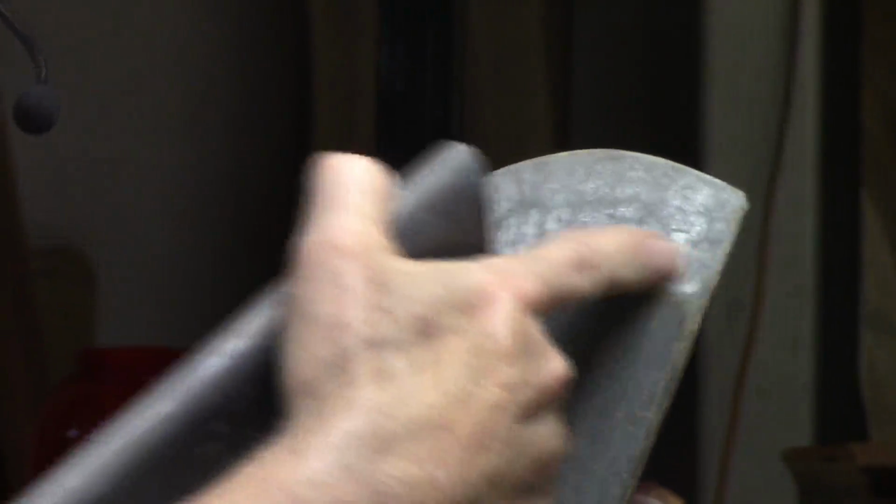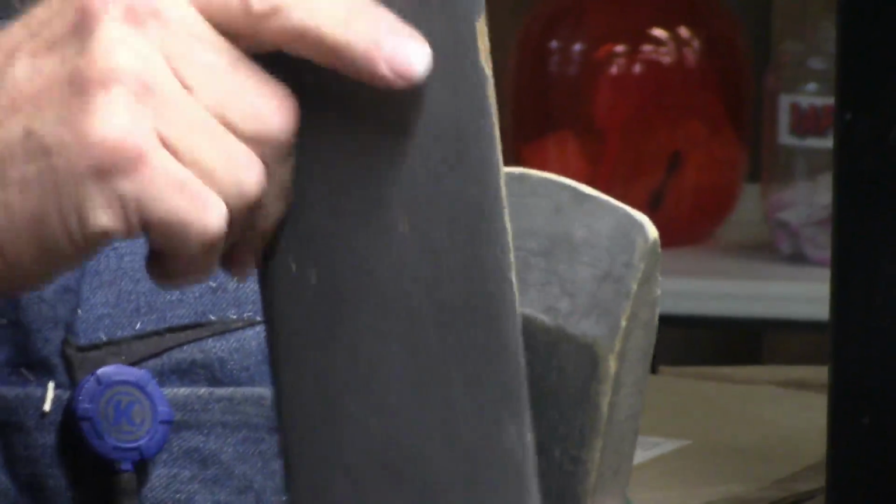Woodturners meet this when they hollow and it cuts the wood. You don't know what did that. It wasn't the edge. It's the back of the bevel. Same with a skew. I want to soften this. So believe it or not, the setup is you're softening the back of the bevel.